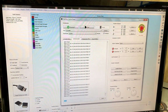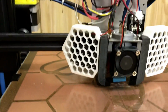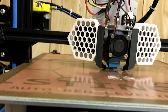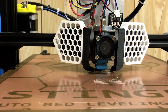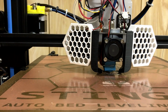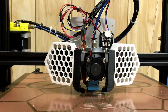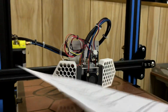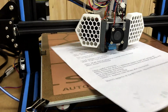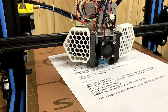We're going to look at our table. What we did was we came down to what the machine thinks is 0. That's where the button activated it. And we're going to come up with the jog controls until the tip is off the table, and we are able to stick our paper in there. This is the offset we're setting now. So I'm going to come over here and stick this in. And I'm going to our paper gauge setting.